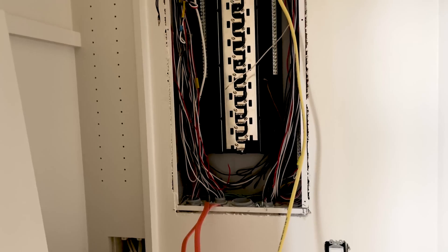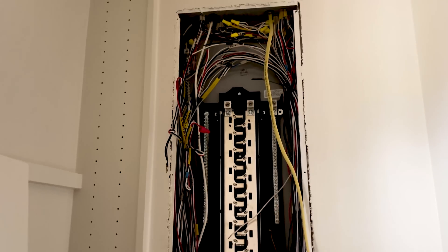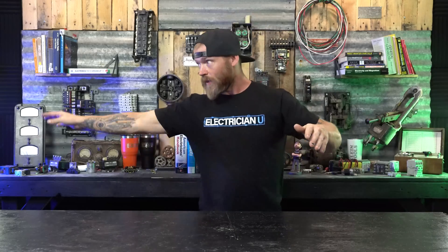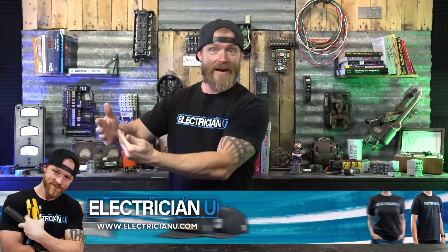Nothing was kept on the plans, so there's tons of stuff that makes no sense. Out of the panel there's a conduit going over to the island with THHN conductors just flying in with no conduit, because it was probably cut off at the floor. There are floor plugs coming out of the bottom of the panel too, used as a junction box to pass through from one thing to another. And the worst part is it's all Siemens — an older class panel where you can't find replacement panel covers.